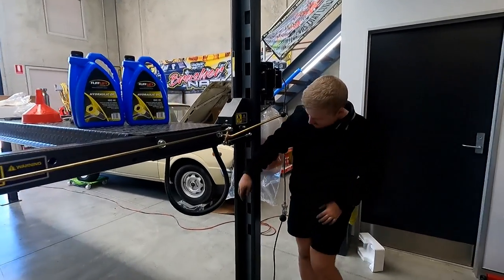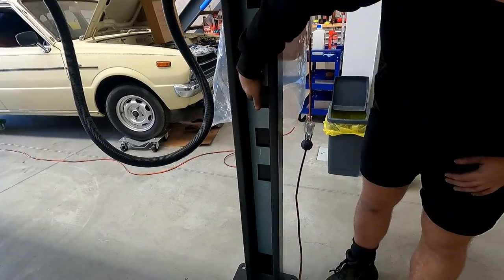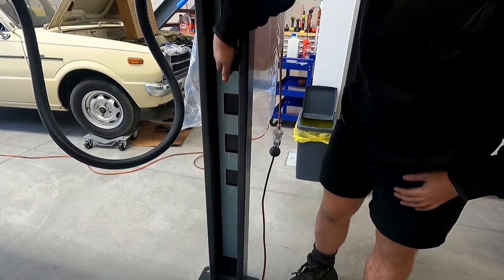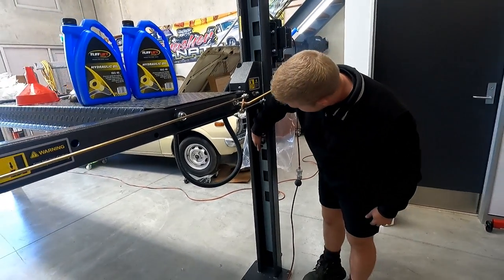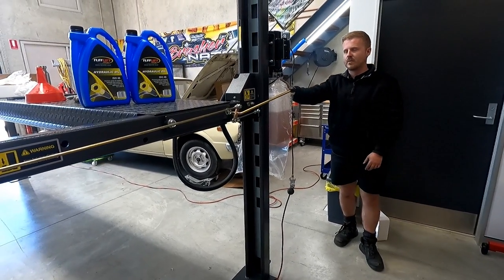All that means is it's dropped in here, you've gone clunk. And when the handle is moving, that's it going like this, and when it stops, that's it traveling up there. So when you're waiting for that handle to stop, you've almost gone up to the second lock and you've made sure that you're definitely ready. And then you go back down onto that lock. It's just a safer way to operate the hoist.